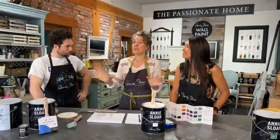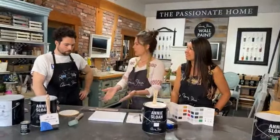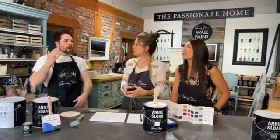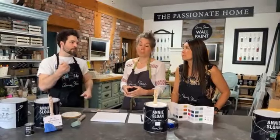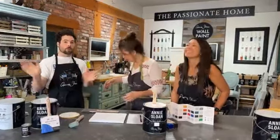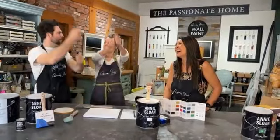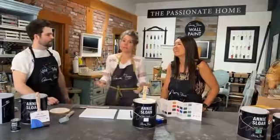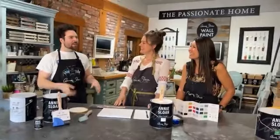Now the wall is done. Any tips on how to clean your roller and brush? First, do you use a pole on your roller? Always — unless the space is too small. I'd recommend the Wooster ones with the Sherlock attachment because they clip in easily and fit everything. You should be doing singular passes with a pole — not getting on a ladder and rolling by hand.